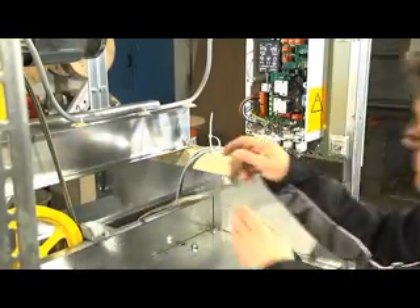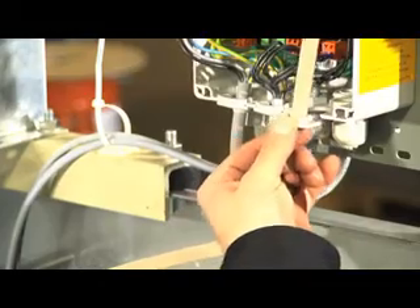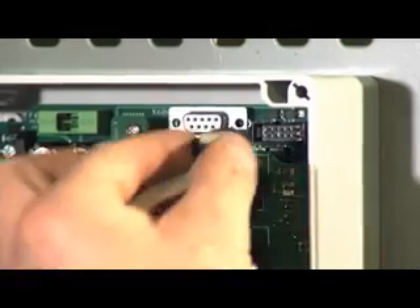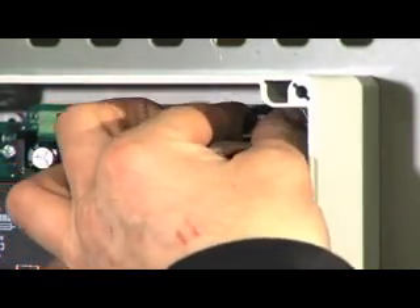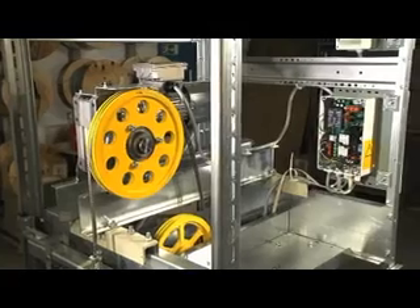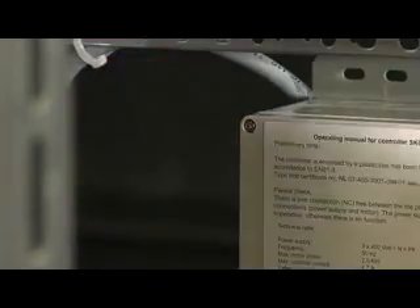The bus cable is a grey flat cable which leads to the push-button stations. Please ensure that this cable is not damaged during installation, as sharp edges can damage the bus cable easily. The 10-pole connector will be connected to X11. This connector must not be damaged or removed, as damages cause malfunctions of the sensitive electronics.